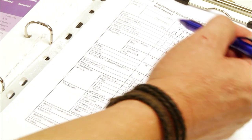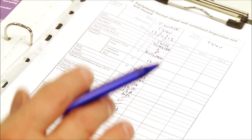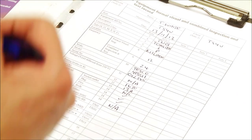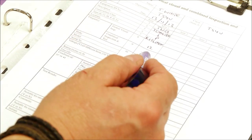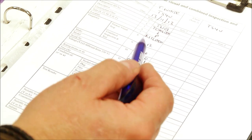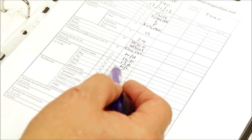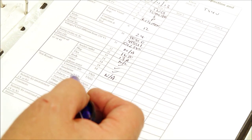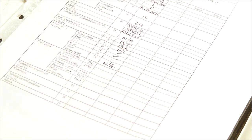You can see I've already started to fill it out. We've got the equipment ID, unique ID number, description of the equipment — it's Class 1, it's portable, its location, the frequency of the formal visual inspection and combined inspection and test, its make, model, serial number, rating in watts, fuse rating, and condition of the socket outlet, plug, flex, and body.